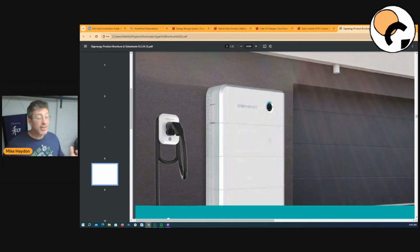What makes these products really innovative, and allows all this to work, is that they've got this power conversion system. If you think about it from a solar panel point of view, it's like an optimizer. Inside the batteries are these PCSs, which basically take the DC from the battery and change it to whatever's required. This is what allows these products to work with your car's high voltage battery. I think the batteries inside are 32 volts. They take that 32 volt battery and jack it up to really high voltages, so they can send that voltage out with really low losses, energy efficiently, through that same bus bar we talked about before. The bus bar is what connects all the DC together, out to your car, and charges your car at high voltages. So that's the real game changer about these.